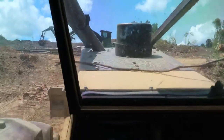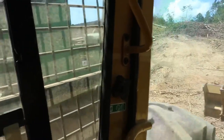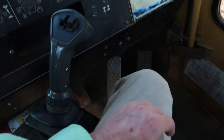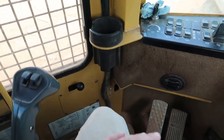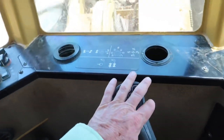We're going to come back up on the hill, I'm going to back up here and park and jump back in my loader again to keep the pile tidied up for Kevin until another truck comes in. Yesterday I probably got up and down on my loader about 20 times. Now here's another cool thing — you're sitting forward, and there's a little thing down here by my foot. I can kick it and this whole seat spins around. You've got a throttle and a brake right there, and when you do that your controls swap too — so when you're looking backwards, your right goes to the right and your left goes to the left.